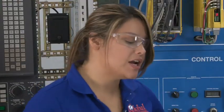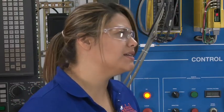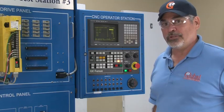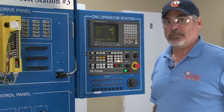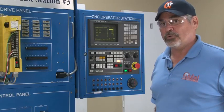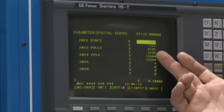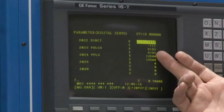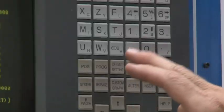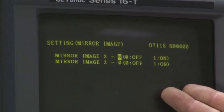That's good to know. John, my customer has an axis motor moving in the wrong direction — why is that? A common misconception is that the motor is wired improperly, but this isn't true. In a digital AC servo system, the CNC creates the waveform and the encoder on the motor monitors the direction. The only way to reverse phase a motor is to change the parameter setting, which tells the CNC whether a positive move is clockwise or counterclockwise from the motor's perspective. Another possibility is a machine parameter called mirror image, which will reverse the programmed move direction.